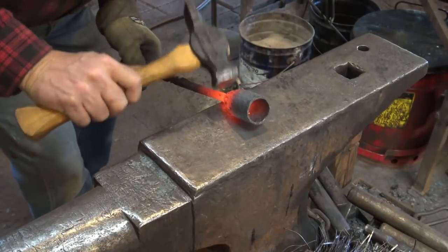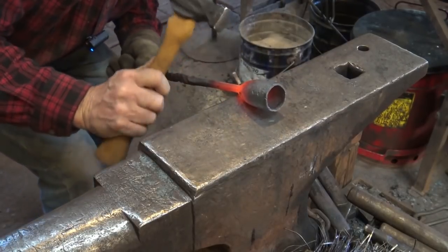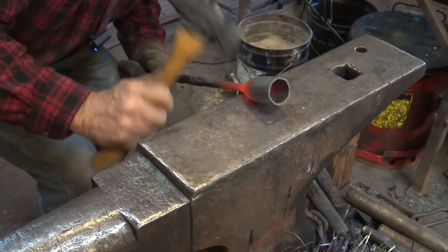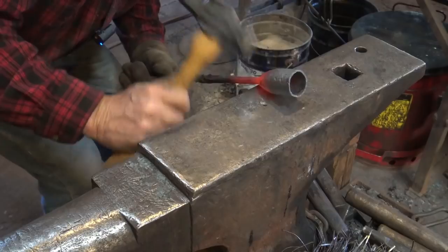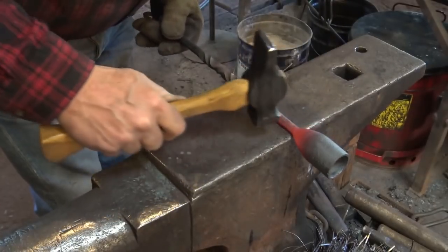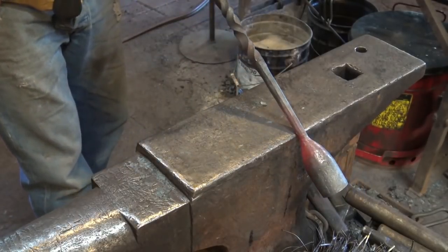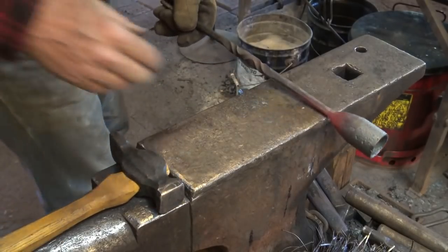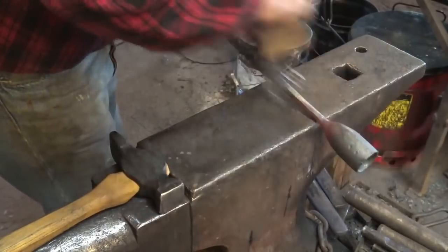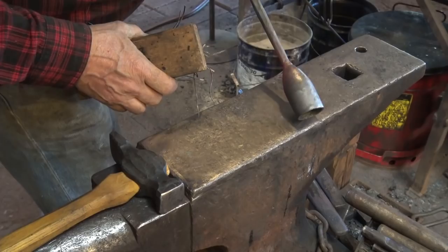I want to blend this with the handle. Remember our handle is a square with heavily chamfered corners, so it's almost an octagon. It's just a matter of catching the edge of that weld and bringing it into that same profile, and then working very lightly where it goes into the socket. That's going to blend that weld much better. It'll never completely disappear, and I'm never going to lie to anybody and tell them it doesn't have a weld. But I want the look to be that of a nice forged piece, not of a nice welded piece.